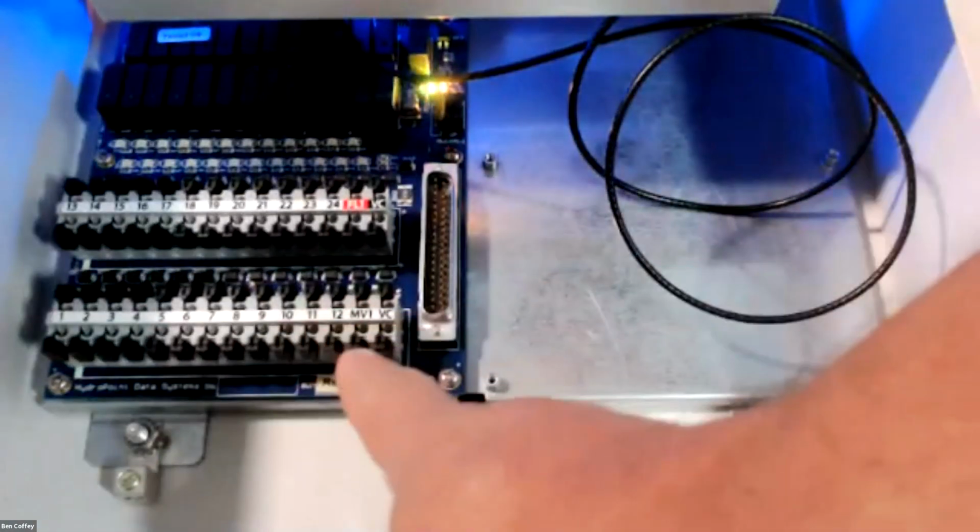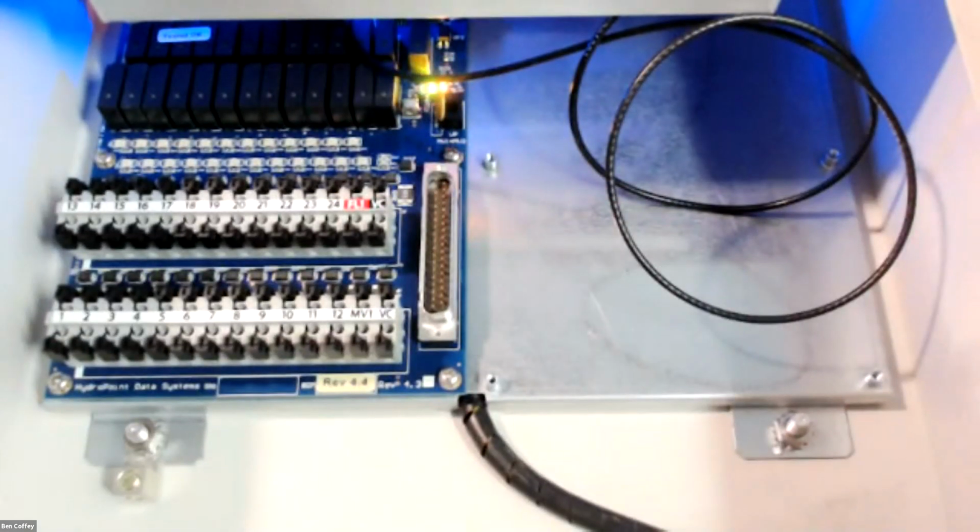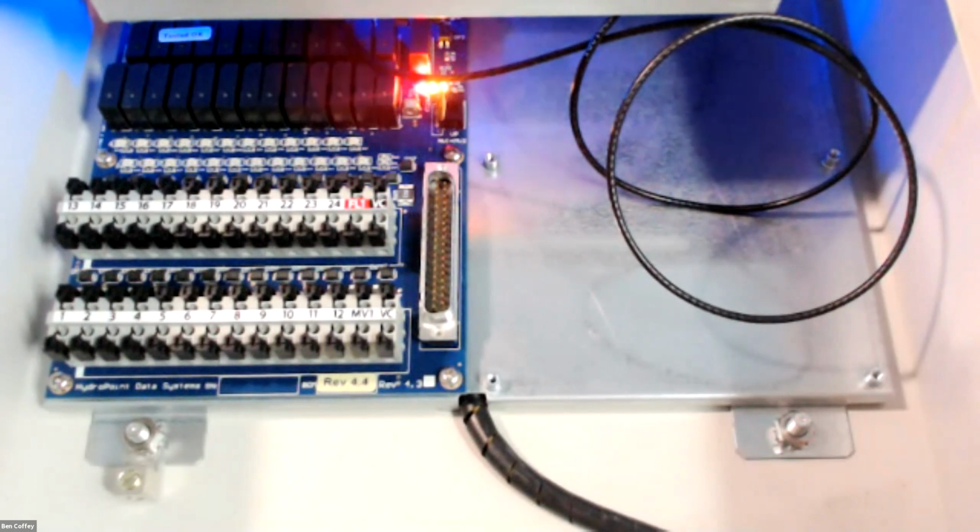All right, so if we zoom in here, it really does boil down just to the electrical components, and you see here all of those wire terminals. Right, this is a 24 station controller. I've got 24 ports for individual field wires, and I've got 1 port for a master valve, and I've got 1 port for a flow sensor. Very importantly, with the conventional wire WeatherTrack, we are able to handle as many as 4 master valve and flow sensors set up on a conventional wire controller.